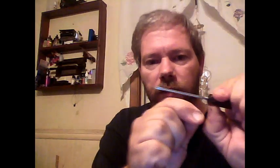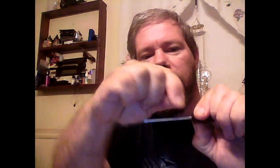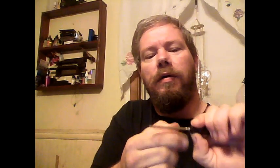Something like that. So, we took 4, 5. We'll say 5 for this, right? We did 5 wraps, right? Now, if we space this out a little bit, and we keep going, 2, 3, 4, 5, right? We have 2 contact coils that we did before. Now, I spaced these out and shrunk them back down, just like I showed you with the other coil. Just grab the ends, rip them loose a little bit, and then squish them back together, which is a little tricky.